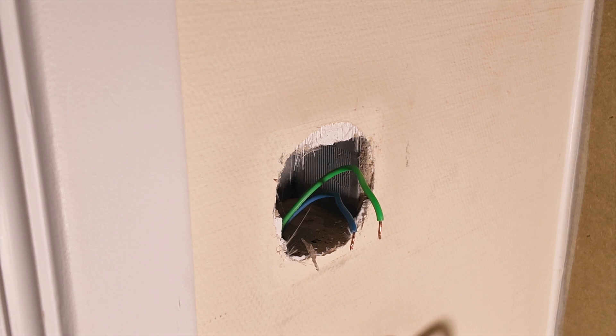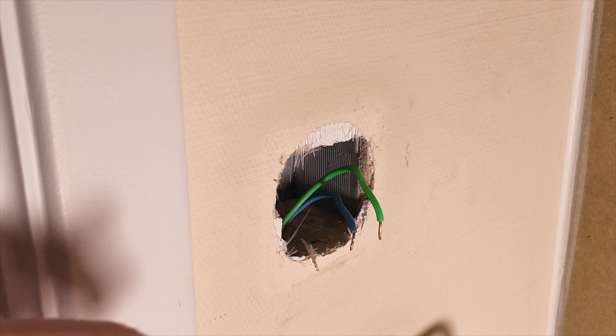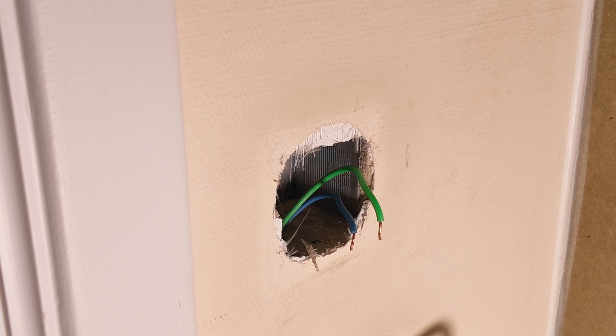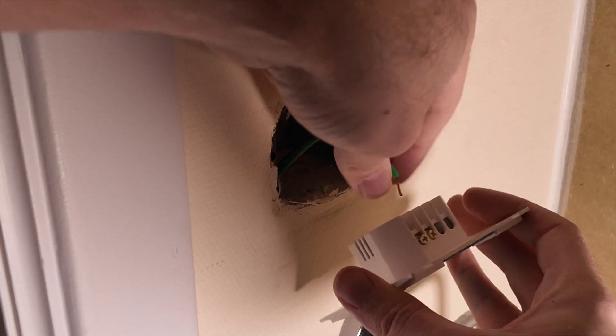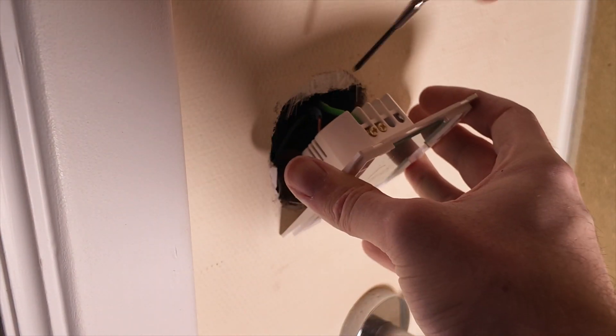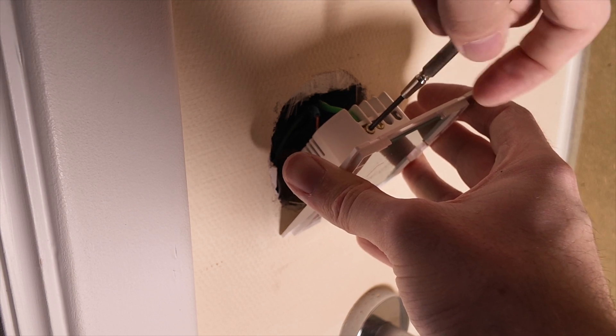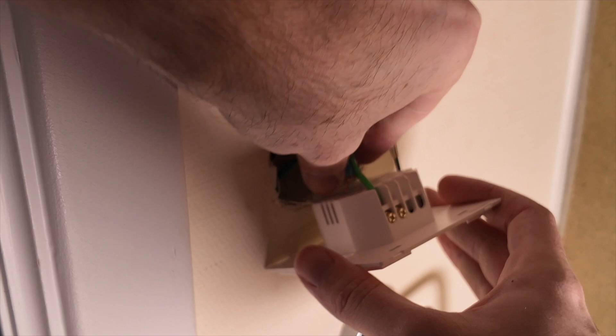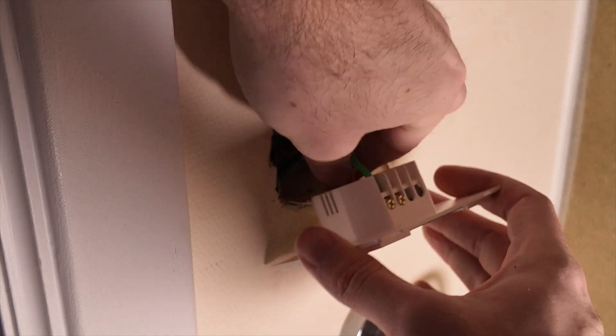Because the hole in my wall doesn't have any screw inserts, I had to order some screw repair tools. It is recommended that you install two of them on each side. Make sure you've separated the wall switch cover from the wall switch itself. Now you can connect the wires to the terminals on the smart wall switch. If you don't know which terminals you need, you can read the manual or search up a schema online.